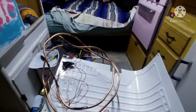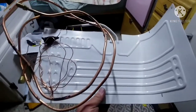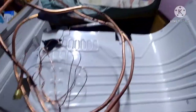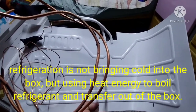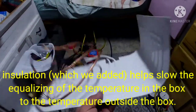This is our test video. First and foremost, let's talk about how a refrigeration unit works. This piece right here is the magic of what causes the system to work — this is what we call an evaporator plate. We put refrigerant into this plate and use the heat that's in the box to boil the refrigerant, which transmits the heat out of the icebox.